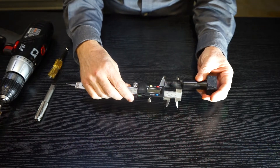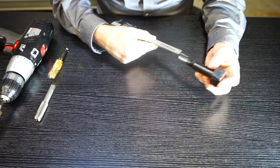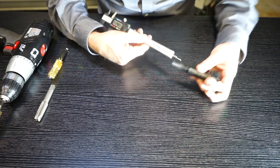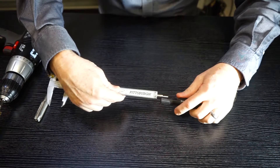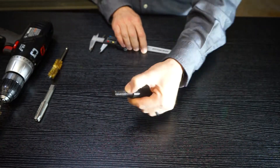That 24mm depth ensures you're not going to strip out the hole or strip the threads on the bolt itself. Make sure your bolt is the right length — it can be too long and bottom out, or if it's too short, you don't have enough threads to grab hold of.